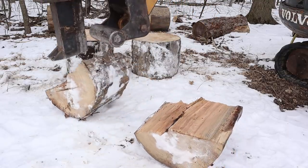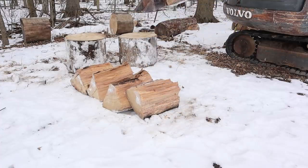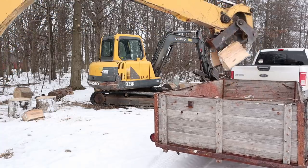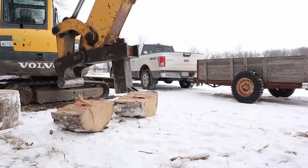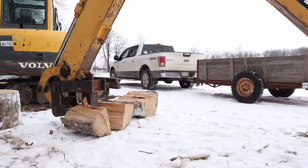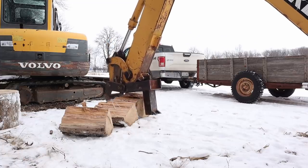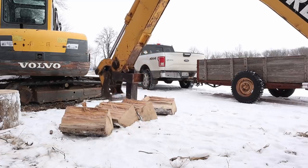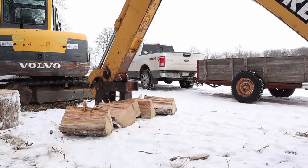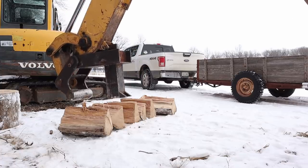Just like that, and you try not to let the pieces fly all over the place. I start halving them down and I hold them up over the trailer. Split it in half, then I just keep halving it. I try to move the stick of the backhoe forward through the log so the logs don't move around a lot. I want to have these halved again before I put them in the trailer. I drive this with the wedge — I just concentrate on where my wedge is and that's how I determine where to go with the backhoe. I pick my spot where I want to land the wedge.